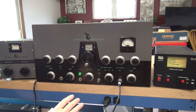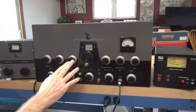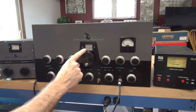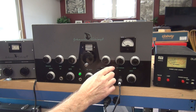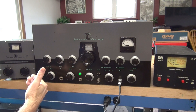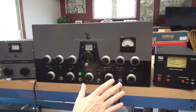Initial control settings: Oscillator somewhere mid-scale, band at 10, drive also approximately mid-scale, plate tuning around 90 on the dial, coupling at 7. Meter will start out at grid. Your crystal select is at zero because that selects the VFO. The rest of the controls don't matter at this time.